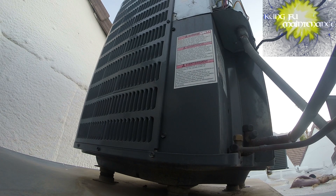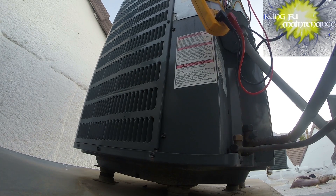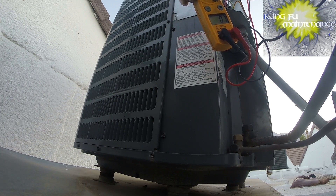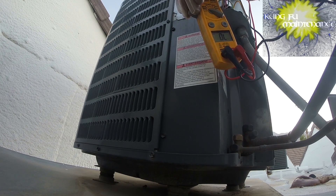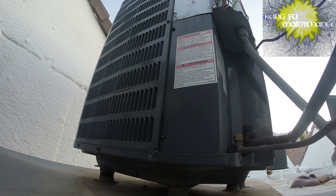Here's the test. It may not be bad, but I thought it was most likely bad, being how it was sitting there and trying to start. Common and Herm — or actually I think that might have been common and fan — but it's 3.9 and that's weak. And then Common and Herm: 14.36, and that's weak. So, yep, we've got a weak capacitor.